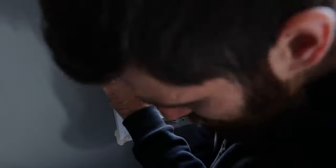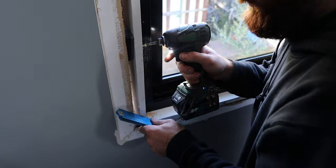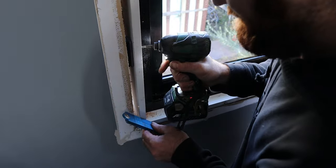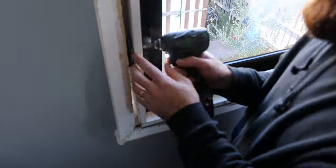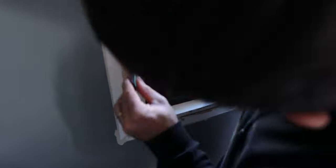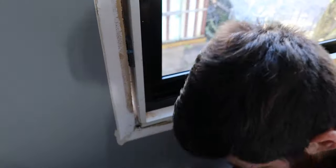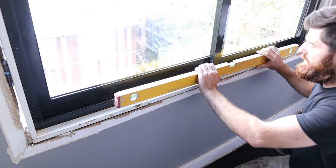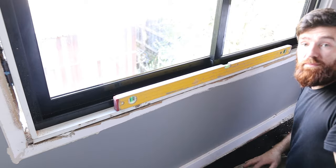My approach is generally one corner at a time. You want to get a straight edge — a level or a ruler — something you can use to check that the window is flush with the plaster. Once you're sure the window is flush, drive your screw in and get some window packers and pack the window to the frame, making sure it's nice and tight by the time you do the screw up. Take your time with this; it usually takes a few goes to get the packers just right. You also want to make sure your window reveals are nice and straight. One thing I forgot to mention earlier is that I already checked the timber at the framing to make sure it was level — check that before you put the window in and anticipate whether you have to pack the window to make it level.